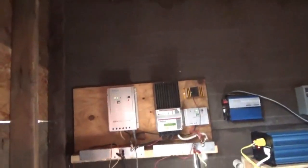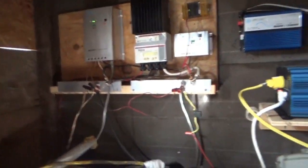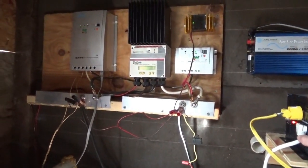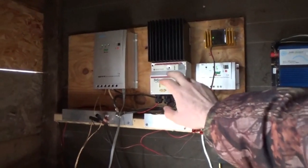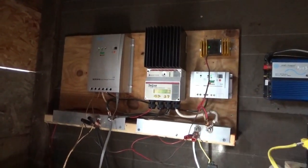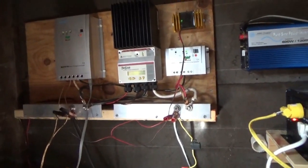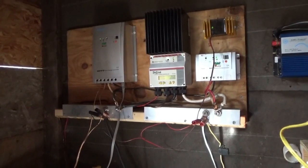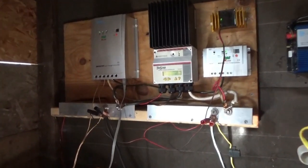We just went into equalize mode and I heard beeping on the inverter. So I manually took it out of equalize, but already at 10:30 or 11, we're in absorption mode. Very, very good already. Very good. But we have been extremely sparing on the battery power recently. So that has a lot to do with it.